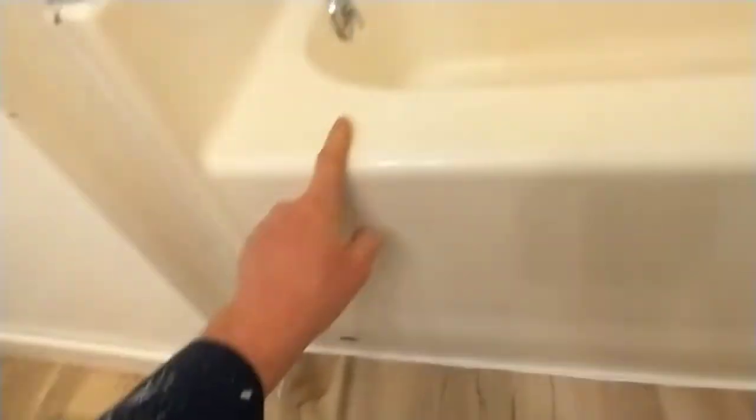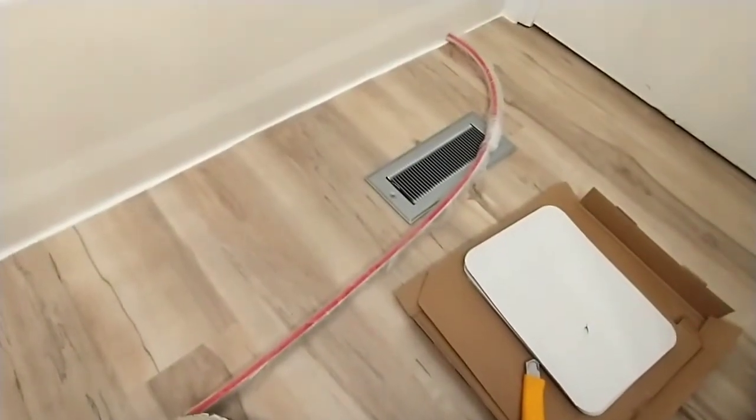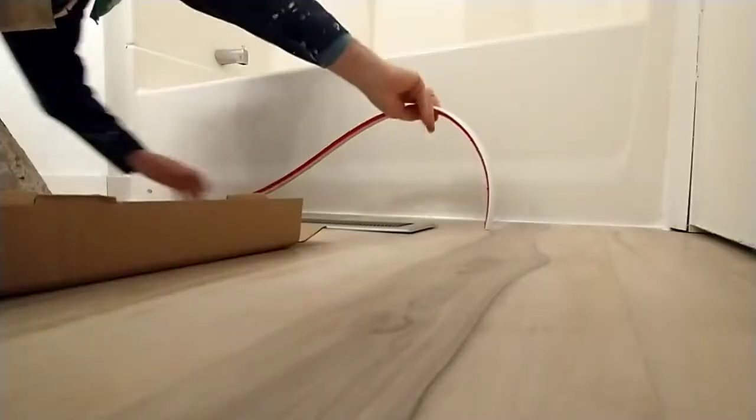Here in the bathroom, I started by caulking this gap, this expansion gap here, a couple days ago with silicone caulk. The manufacturer doesn't necessarily recommend that, but I saw somebody on YouTube recommending it in high water splashing areas. And because this area had rotted out previously, I went ahead and just sealed it all in. Now we're going to put on this stuff, and I think in here we'll stick it on both edges.